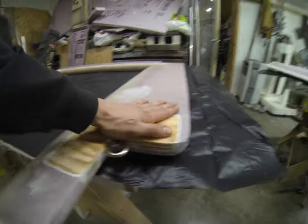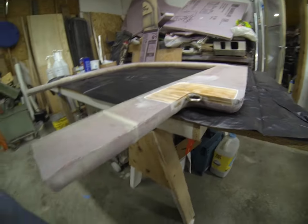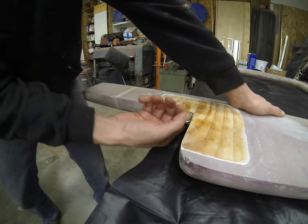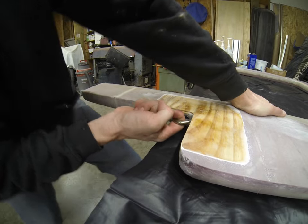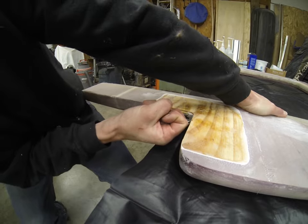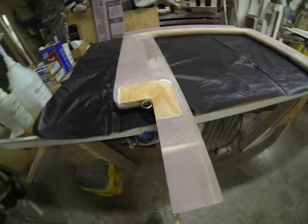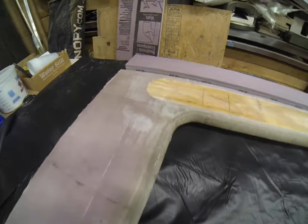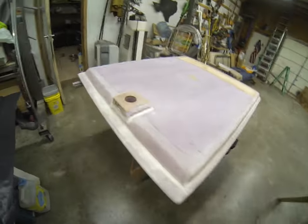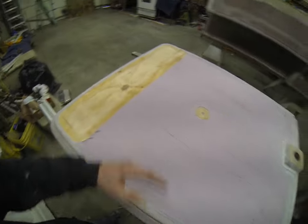These things turned out great. Went ahead and sanded them with some 80 grit so they're ready for glass. I'm already really happy with how perceptively strong they are. It gives you hope. We're going to get some glass thrown over the top of these guys — our hinge hard point there at the top, around the box, the skin of the door and its upper hard point.